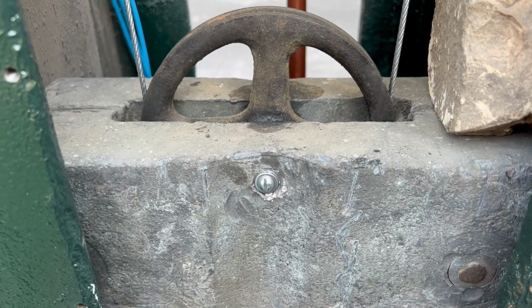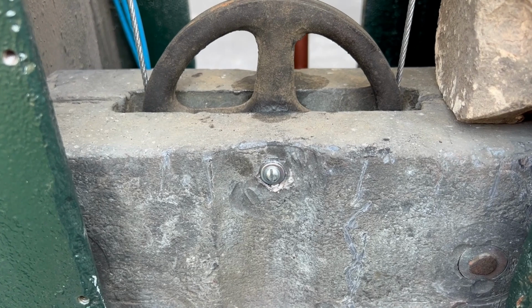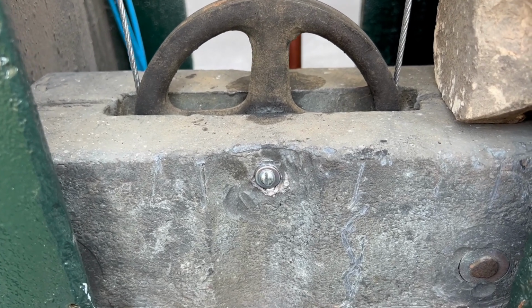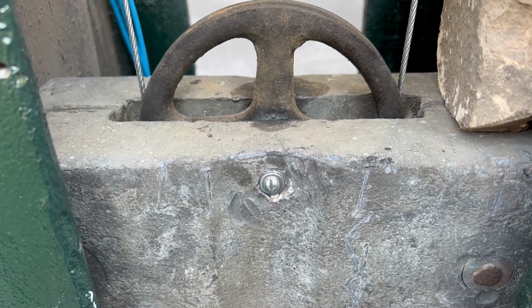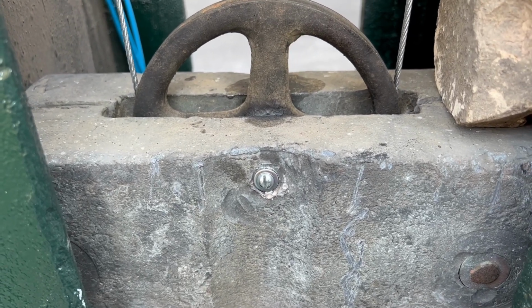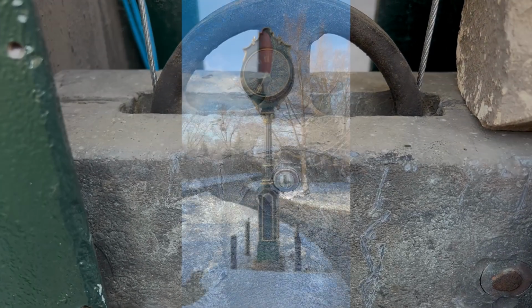For the weight, we were initially planning to peen the shaft over to make it like how it was, but we ended up not being able to pound enough to make that happen, so we ended up drilling and tapping both ends of that new shaft, and it's fine. There's some Loctite on it, and it's not spinning, so it's gonna work great.